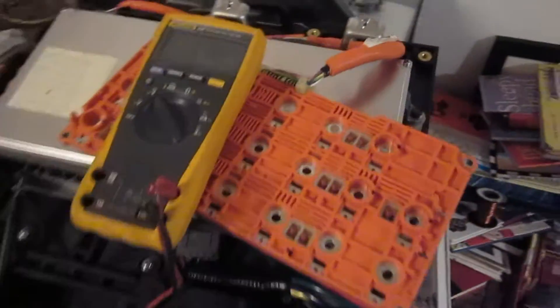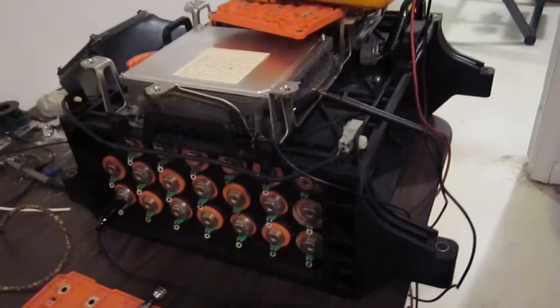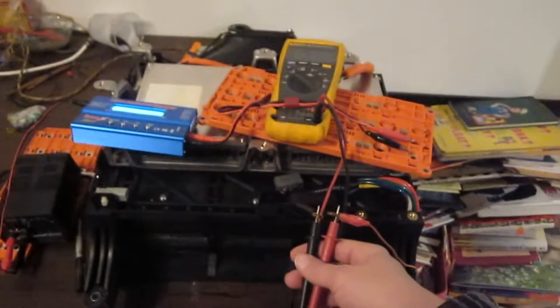Here we have the battery apart, and I'm just hooking clip leads onto the batteries. It seems easier to test them inside the box rather than pull them out, because it would bend the thermocouple tabs. I've made a little table of the battery voltages, and they're all kind of in the same ballpark. I was expecting to see some that were bad — some were about 7.2 — but I was expecting to see one with very low voltage and I didn't. We're going to start out trying to charge the lowest battery, which is 7.2.